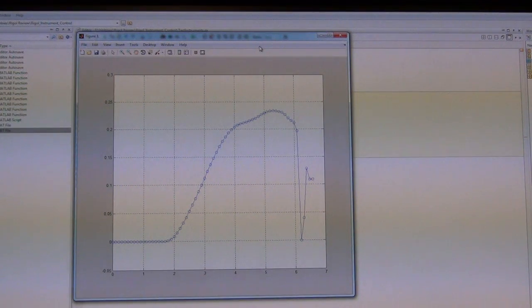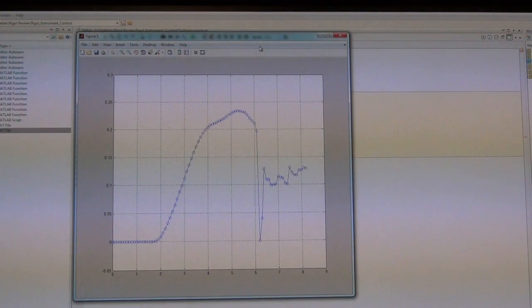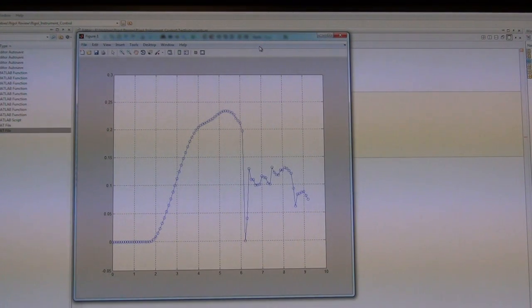Oh, that's interesting. Some dip in the curve there. I think it's just the core of the LED, where the semiconductor and the aluminum plate is all molten. So you can have connection disconnections as the temperature changes. So the current is still at 120 milliamps. Now, okay, it's not dropping. So I believe that was it. Now it's still taking 70 milliamp or so. So it's going to continue going. Let's see if we can keep that up.